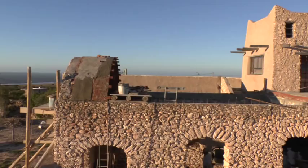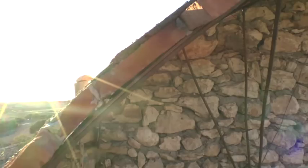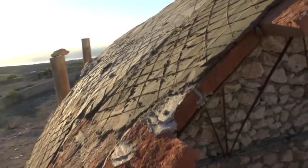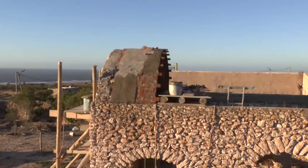It's been a bit of a trial by fire. We use lime over cement wherever possible, but the local lime is of mixed quality and it was soon clear that it wasn't strong enough for this even when mixed with cement. There's actually about a centimeter gap — you can just see the light shining through — and that's going to present problems when we come to move the form. The first meter had to be taken down and rebuilt with cement and sand only.